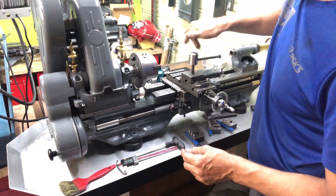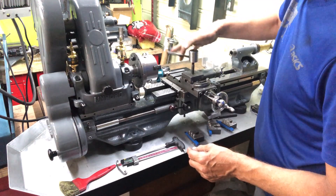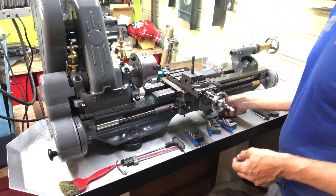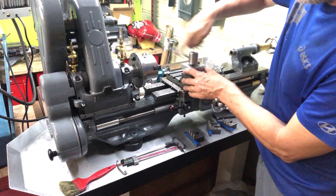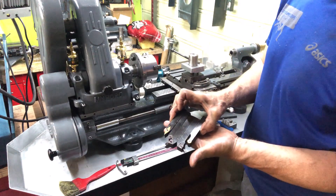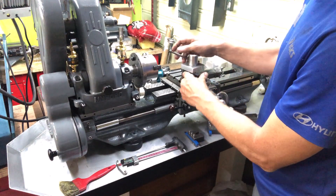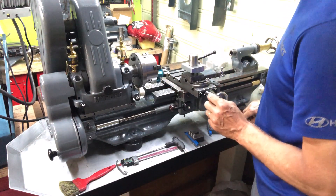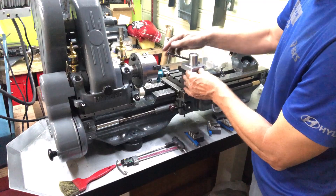So that's my quick change tool post system. I also made use of some 16 millimeter tooling again, with another type of holder — just what I had lying around in aluminum — and then a set of 16 millimeter tooling. No need for any elaborate quick change tool. I can call it quick change because they are all the same height, so you can easily just move around from one to the other.